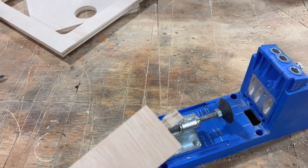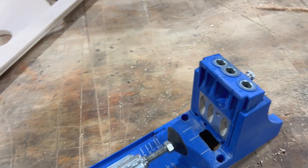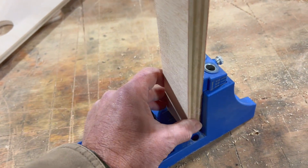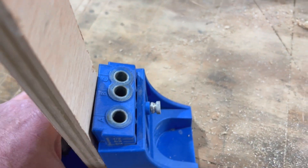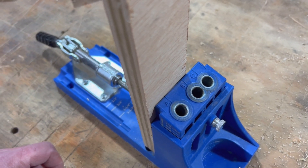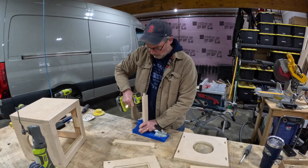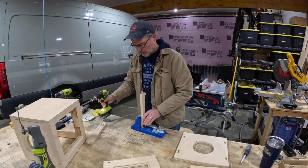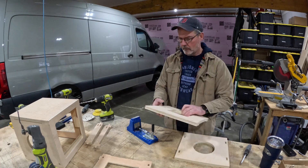Since I'm mixing mortise and tenon joints with pocket holes, I needed to do a modification to my pocket hole jig — the tenon needed space, so I just drilled that out with a little Dremel work and made a slot. Now I can fit the spreaders or an entire side in and put in the pocket holes very easily as the tenon just drops in. The modified pocket hole jig made it really easy to drill pocket holes on the spreaders and side pieces. This is just a test cabinet — the actual van cabinets will be much larger, but it should all work out really well.